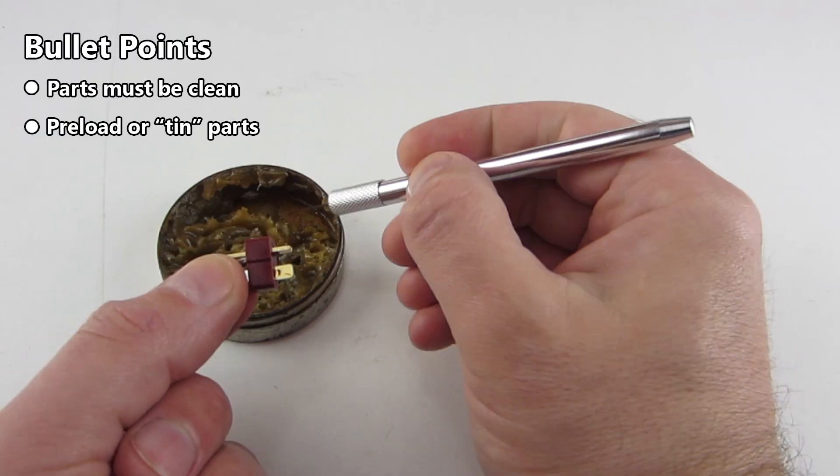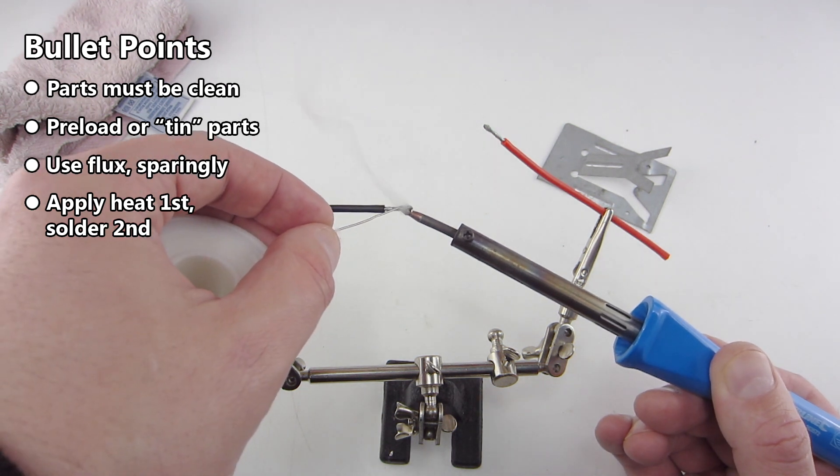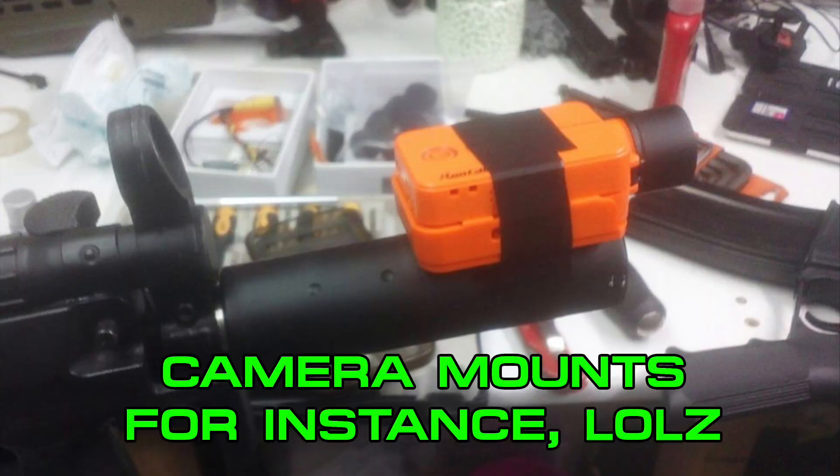Tinning makes life ten times easier. Also, tin any metal tabs that you're going to solder to before you make the joint. And when you are soldering onto metal tabs or connectors, don't be afraid to use a tiny bit of acid flux — although you'll see online it isn't really recommended, most of it will burn off anyway. Just don't use it near fine electronics, circuit boards, or components — it will cause corrosion if traces are left behind. When you go to solder, always apply the heat first; give the component time to heat up before flowing the solder in. Heat first, solder second. Make sure you insulate your joints properly — if you leave them bare or poorly insulated you risk a short circuit. I use heat shrink where possible: it gives the quickest and easiest results and good insulation to the joint. Don't mess about with insulating tape — heat shrink is an easier option and takes no more effort, and it's cheap. A heat gun is cheap as well.